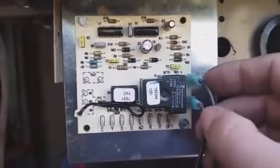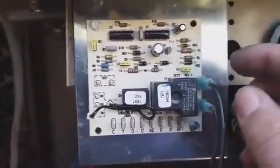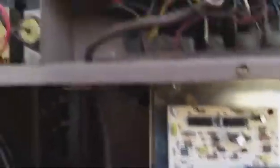We have our two wires here on the outdoor fan motor relay running up to the fan motor contactor — we're intercepting that wire going up there. Basically a jumper extends from the compressor contactor up to the fan motor contactor, and we're just interrupting that at this relay. What we're gonna do now is grab some of our low voltage power from our terminal strip right here and tie it into our board.